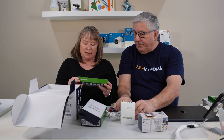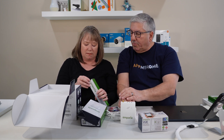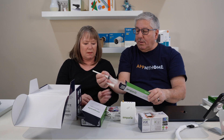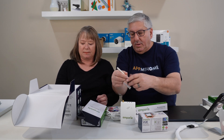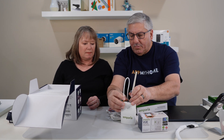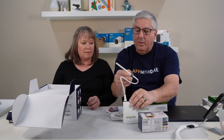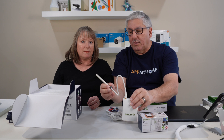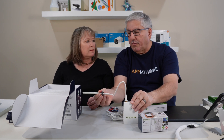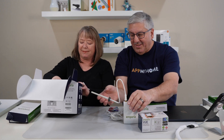So there are two of those clamps that come in here. The accessories box has a couple of odds and ends — including the antenna, which hooks onto here. Look at this — I can assemble this myself. It's an antenna, but they have a little gasket because the way it works is you put it inside the electrical panel, and then this goes on through the knockouts on the side of the electrical panel so that it's sitting outside the metal box. Otherwise your Wi-Fi won't work.